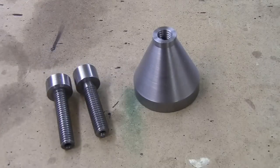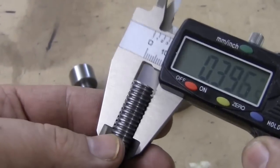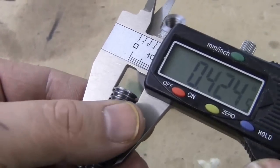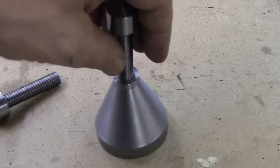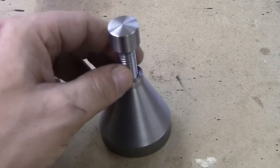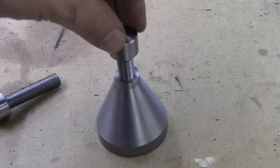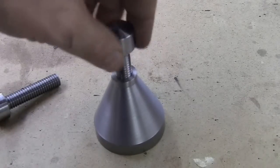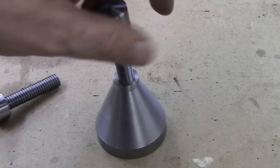I took a quick measurement here just to see what the final result ended up being in difference. The original one I made was just about 400, and this one is now 425, so it's a little bit bigger in diameter. Surprisingly, there's still room in this jack stand for this to wobble around a bit — so I probably could have made it even bigger. As a matter of fact, I actually stopped and tried to thread this at a slightly bigger size and couldn't manually get the die to start, so I took a little bit off, and that turned out to cost me still a little bit more precision. But it still turned out better than the last one, and only about an hour's worth of work.